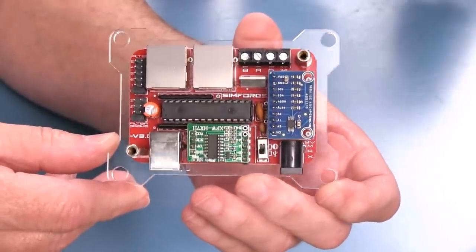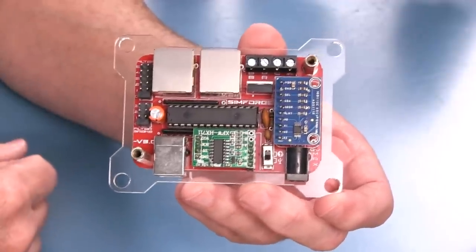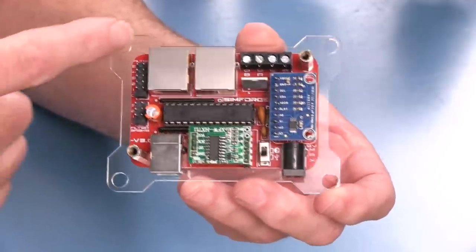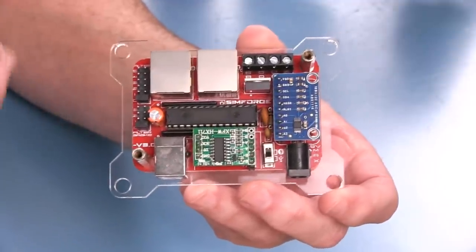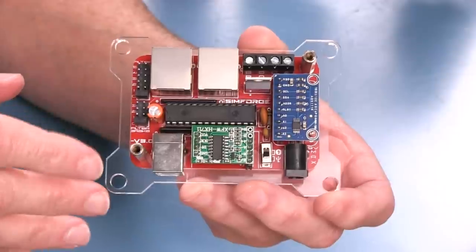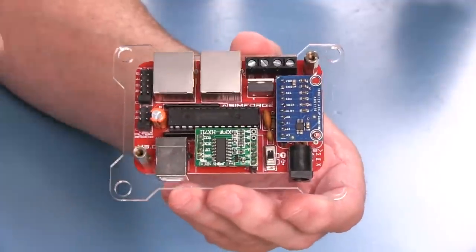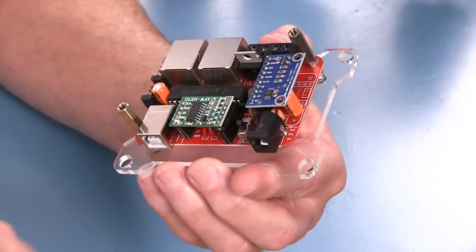So as you might imagine, that has a very good potential to screw around with the electronics, because of all the EMI that's bouncing around, and it's not just airborne, it's through the cables themselves, the power cables. There's a lot of places for it to happen. And even the circuit loops, the ground loops, can cause it too. So what they're trying to do here is give you some filtering options and also increase, I guess the best way to put it, resilience against EMI. And also they're updating the 12-bit to 16-bit on the throttle and clutch. And we'll talk about that board first.